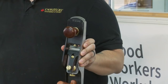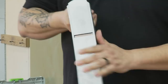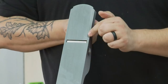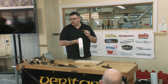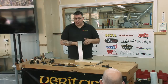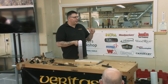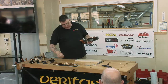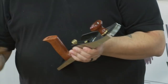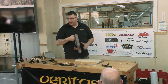I advance the blade to a non-sensible cut, then look down the sole to see if one side is sticking out further than the other. Right now it looks a little high on the left-hand side. As with any hand plane, you move the lateral adjuster in the direction it's cutting high — in this case left. You can move it with your fingers or give it a light tap. I like the tap method for very fine adjustments. I also keep the lever cap in place while adjusting.